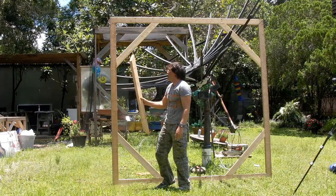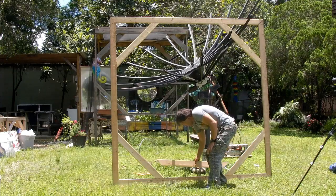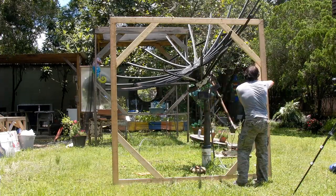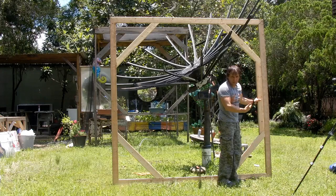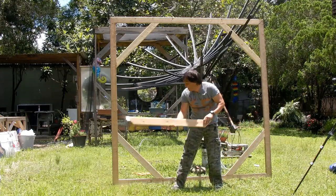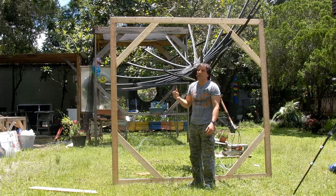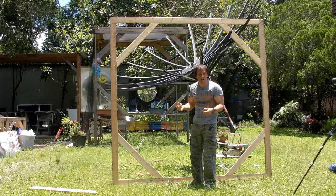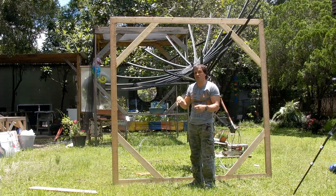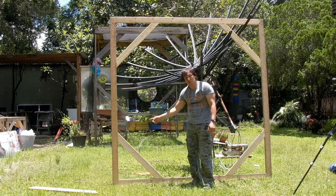I have this piece that pops in there and fits perfectly — it fits perfectly down there, perfectly over here, and for the top one you're just going to have to trust me. This is a good number for contractors to have on hand at a job site. If you have a client that has a skylight that is square and they want to convert it into an octagon, all you have to do is measure the inner portion, multiply it by that number, and you know exactly how to cut your 45-degree braces.